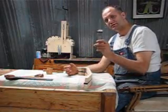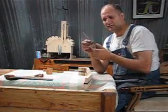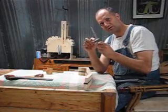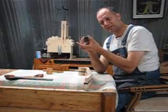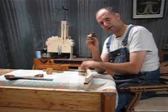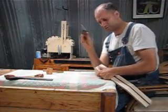gauge? And basically what this is, this has one dovetail for the block and then a larger one for the neck. These are skewed at a 2 degree angle, and then they also sit on a tapered thing here, which allows me to mark how I'm going to cut the actual taper of the dovetail. So I know that's a lot to absorb, but I'll show you kind of how it works.